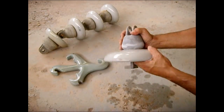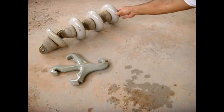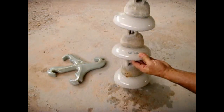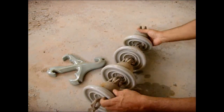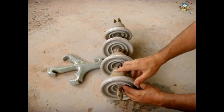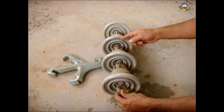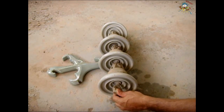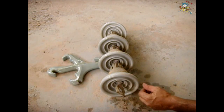Now if you needed more than 15,000 volts, what you can do is connect a bunch of them in series, like you see here. Each one of these is rated 10,000 volts and you can see it says 1969. This would go on to your pole, and clearly this would carry a lot of voltage — with four of these lined up, that's four times 10,000 volts, which is 40,000 volts. So this string was probably safely carrying around 25,000–30,000 volts, because you don't push insulators right to their limit.